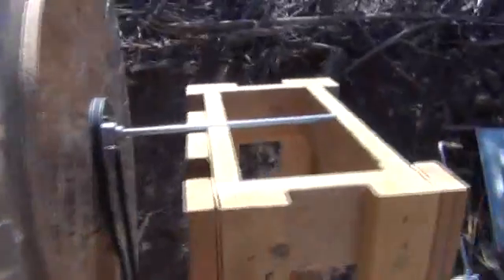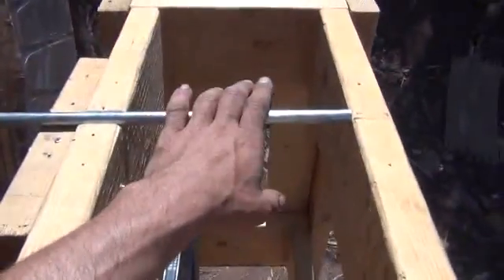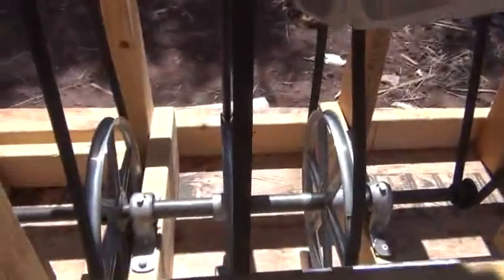You notice the rod comes all the way to either side, which will also be another area to do other experiments. We'll have a pulley coming off the drive rod here going up onto the shaft, which will turn the device inside this area also when we're done. So we've got our massive Wimshurst disc ready to go. We also have our high voltage AC or DC generator, which is also hooked up belt-wise. We've got three 10-inch pulleys at the bottom — these two going up to the Wimshurst into a 5-inch disc, which from hand crank to disc is about a 14.3 to 1 ratio.